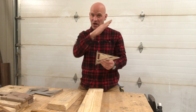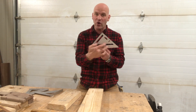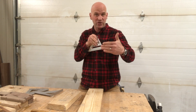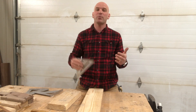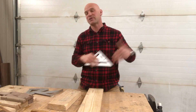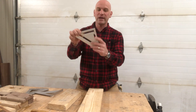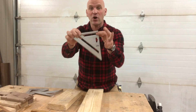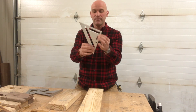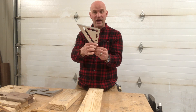The pitch of a roof or the angle of the roof can be calculated mathematically, and these are those angles. That's really helpful when we want to set our miter saw up to a certain angle to make a bunch of cuts for rafter tails or what not. This square has a point that says pivot — that is always going to be the pivot point in order to use these numbers. We have common rafter numbers and we have hip and valley rafter numbers.